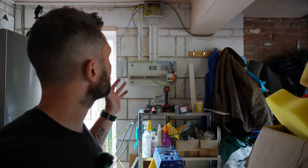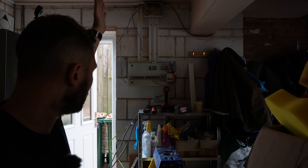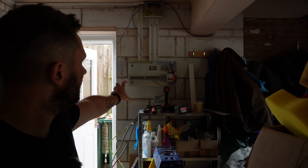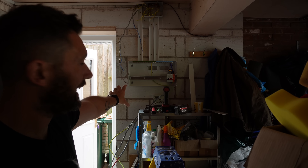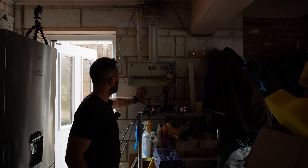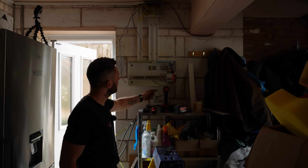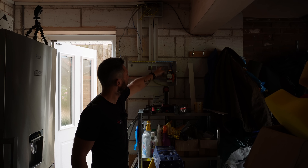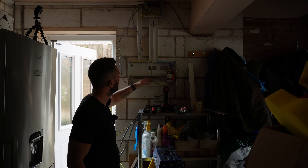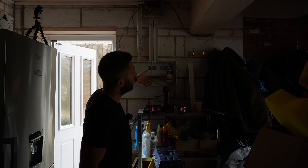The trunking is now in place. I've decided to go with all the PV stuff on that side because I'm going to bring the mains isolator down here - around this location. I'll sort out this mess. The meter tail is going to come through the back into here. I'll use the existing ones but cut all the bad bit out, extend them through and drop them down.